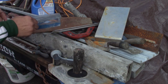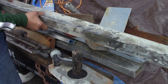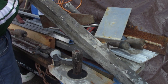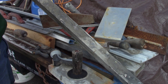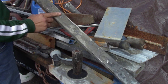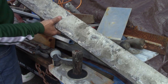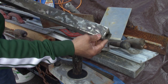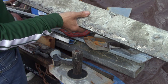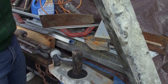This is what happens when you don't clean off your tools. This is aluminum screed, and the paste of the concrete will bond to the screed. This took me about half an hour to get back smooth again, grinding it back because someone just threw it back onto my truck without cleaning it off. Now, as you can see with my fingers running across it, it's smooth. These three surfaces don't bother me as long as this face is all flat. That's your aluminum screed.